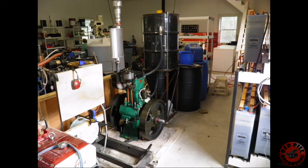Okay, there's another picture. This green thing over here is the neatest thing. I love it. I think it's the best thing since sliced bread. It's very primitive. It's a diesel engine. It's a very old design. It's ultra reliable. It has a very long life. It turns and produces electricity for me at 650 RPMs, not 3,000 and something. Not 3,600 RPMs. RPMs is what determines the longevity of an engine.